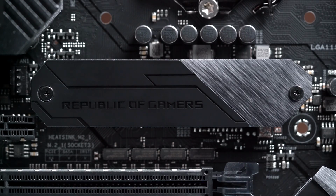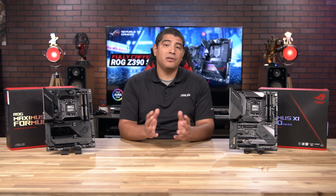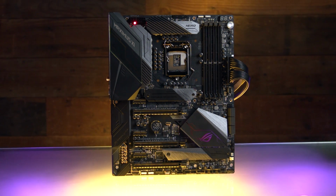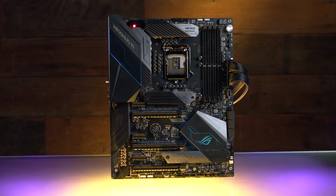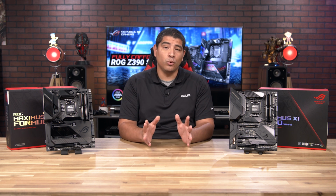And of course, for that kind of next level cooling performance in the highest end M.2 based drives, especially for users that are considering RAID configurations, both these motherboards come equipped with M.2 heatsink designs, so that if you want to pair the highest performing M.2 based SSDs, you can make sure to get the best performance possible from them, even under heavy loads. And more important is also their location and placement. For both these boards, we've also isolated the M.2 drives so that they're not directly underneath the primary x16 slot for the graphics card. This is important because this really helps to minimize any type of heat pooling that you might have. So all the way around, whether you're talking about the connectivity or the controls, these boards are definitely going to have you with a cool running system.